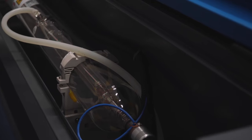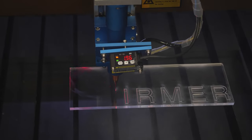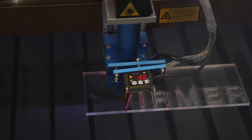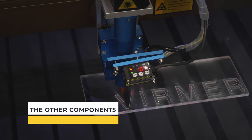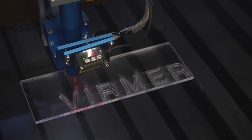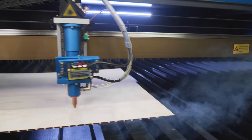The FOTEC inductive end sensors are installed on the machine. Their actuation distance is 5 millimeters, which prevents collisions of the gantry elements. In addition, end sensors ensure the most accurate positioning. The FOTEC end sensors are less prone to contaminations and have a longer service life than mechanical ones.